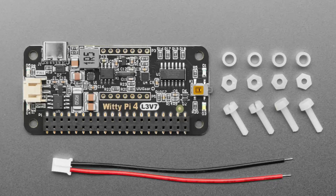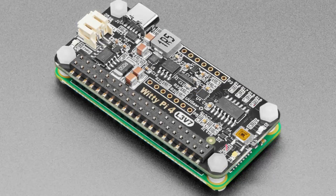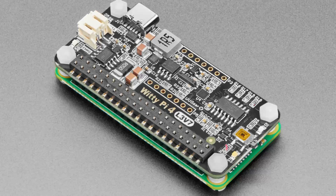Sorry, I just want to note one thing. This is kind of designed to plug in directly into your Pi Zero or Pi Zero W. And you see how the socket is in the top, the pins of the Raspberry Pi plug through the board and up to it. Now, you could use this with a Pi 4 or any Pi with a 2x20 connector, but you'll want a stacking header that extends the pins up, because only the Pi Zero is flat enough for this to sit around the bottom. So you may need to get an extension header, which we stock in the shop and we point to in the description, to lift it up above. Or if you have a Pi Zero and you want to keep it nice and slim, this style is good.